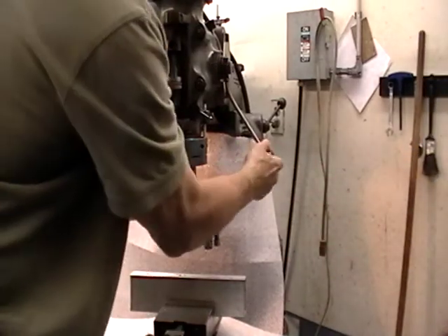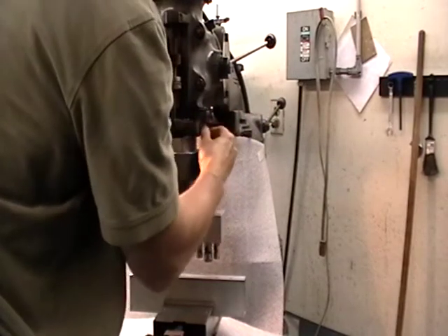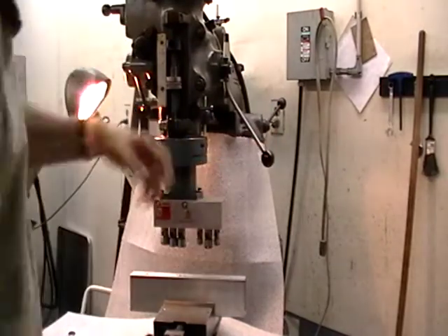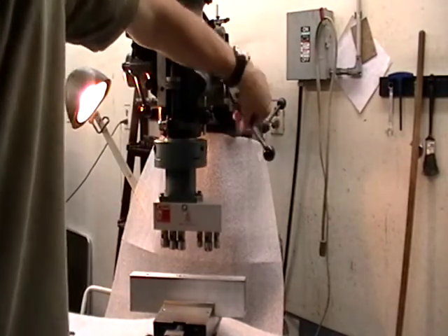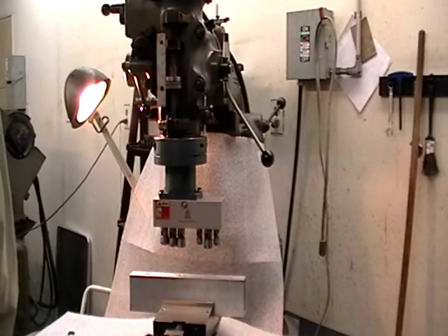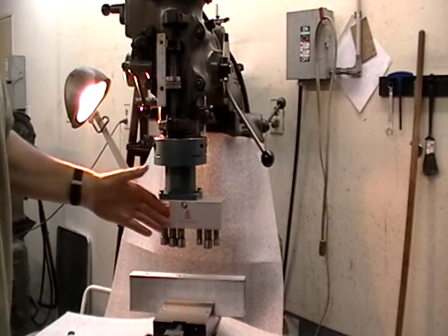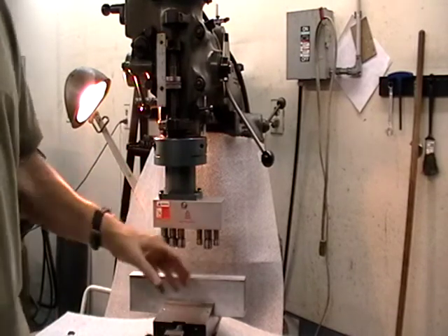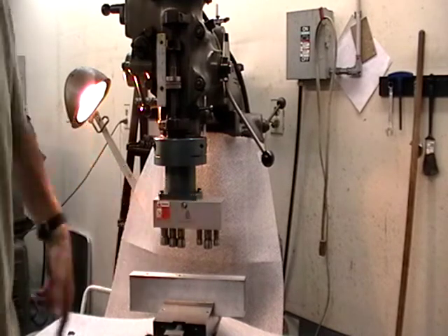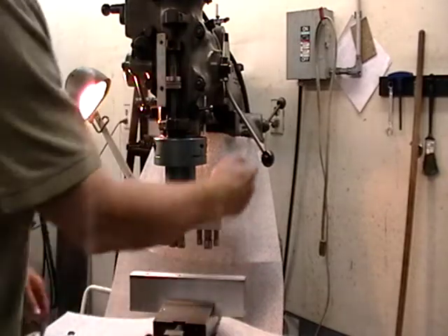Now what we'll do is we'll end up stroking this forward and then we'll back the gauge or the alignment pin up. This way you can fully retract and stroke the quill to get your full range of travel. And then we can actually start this up. Right off the start, you're within a few thousandths of having the head in line with the cross table. And essentially, you're ready to go.